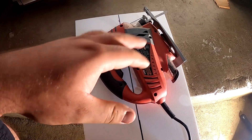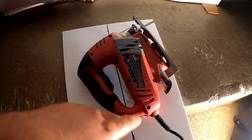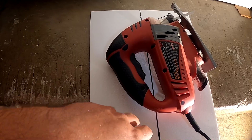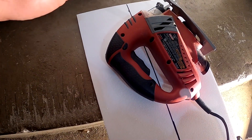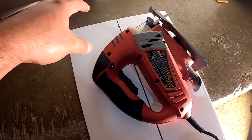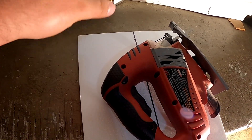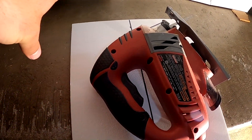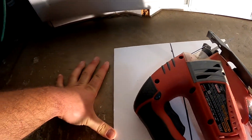Now that the spreader lights are hooked up and the anchor light works, and the bilge is wired, we need to create a new switch panel. I've got a piece of quarter-inch starboard that's going to go right below the helm. I'll use a hole saw to cut out holes for our switches. I'm really excited — the push button LED switches I got are really high quality.